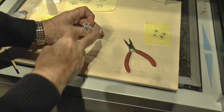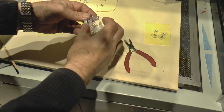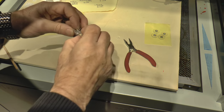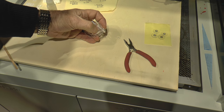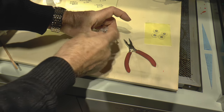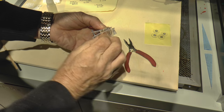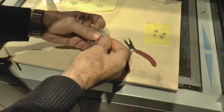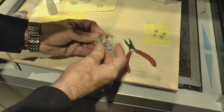What I want you to do is look at the top here and you'll see the two nuts like that. Now what you've got is like a little universal ball joint which allows the laser pointer to pivot around. I tried using springs, but springs are not the most successful thing because they have a tendency to lock on these threads because the plate is at such a steep angle. A very successful method was to use an elastic band. We can take a small elastic band and put a couple of twists in it, and that makes a very successful and very flexible non-locking spring mechanism.